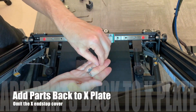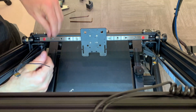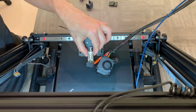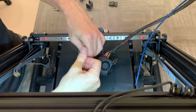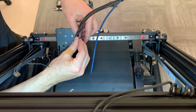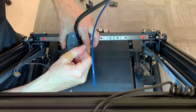Now it's time to reattach the X-plate using an additional four M3 8mm screws with washers. The rest of the components now go back on the plate the same way they came off, with the exception of the X-end-stop. The cover for that interferes with the new hole pattern, so we take the cover off. When we go to reattach the X-end-stop, the two threaded holes already exist on the right-hand side, and just use the screws that came with the cover to put the end-stop back in place.